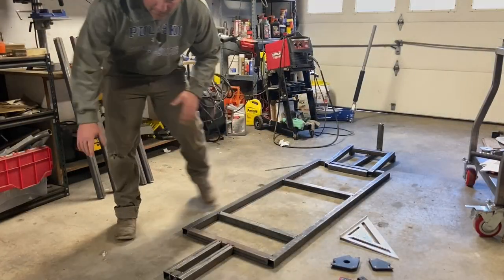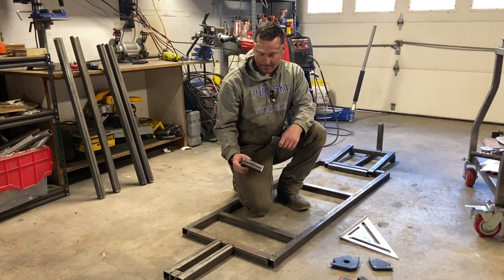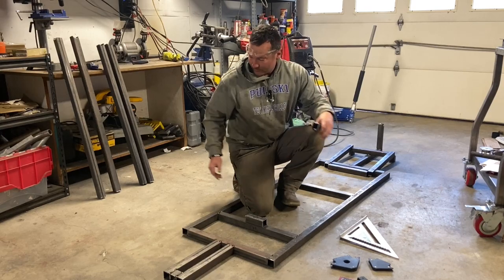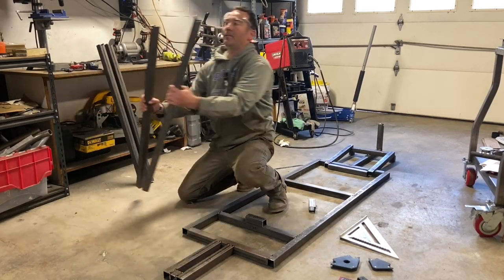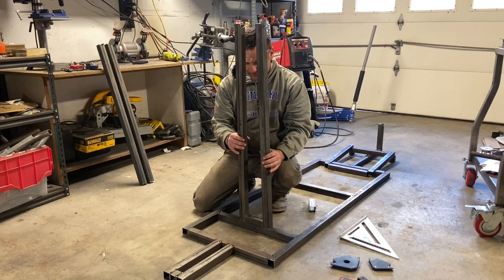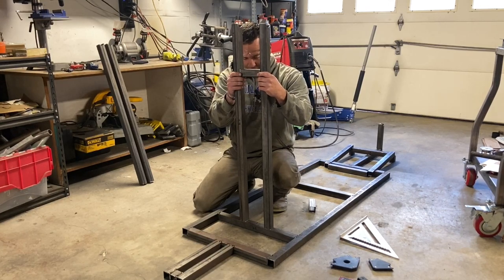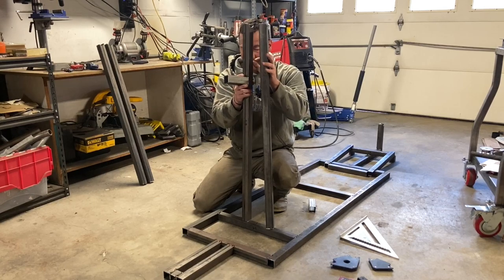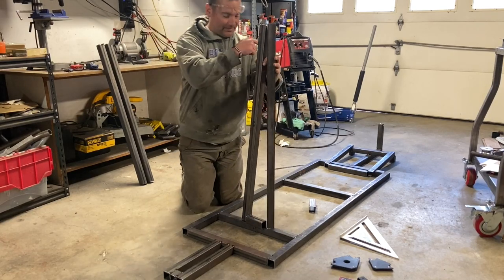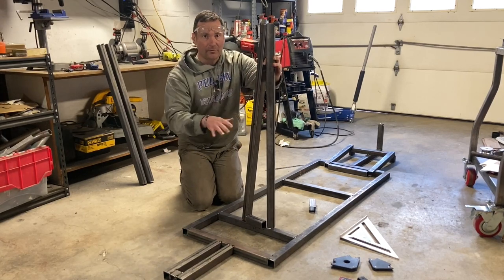The time has come for the uprights. I've already notched them and showed you how to do that, but I'm going to show you a little trick. I've marked the center of these pieces and I'm going to line this up so the spacer is centered. The rear uprights go back here — I'll use that as a spacer to set the correct space, then tack them in and move the spacer up to tack the next one. You have the option of making multiples of all these pieces to help with alignment. I'm going to get all four uprights tacked in first, get them as level as I can, then use the cross members to set everything square to each other.